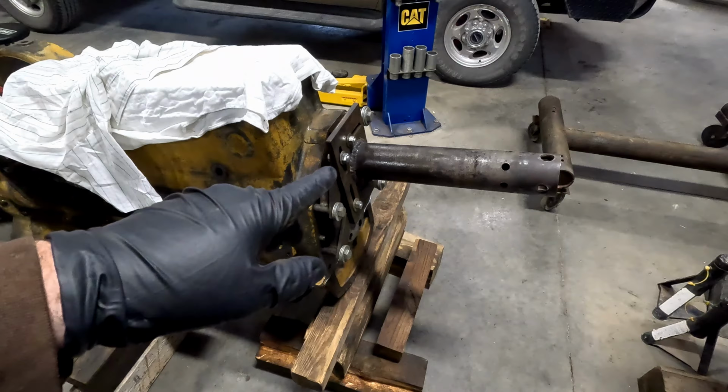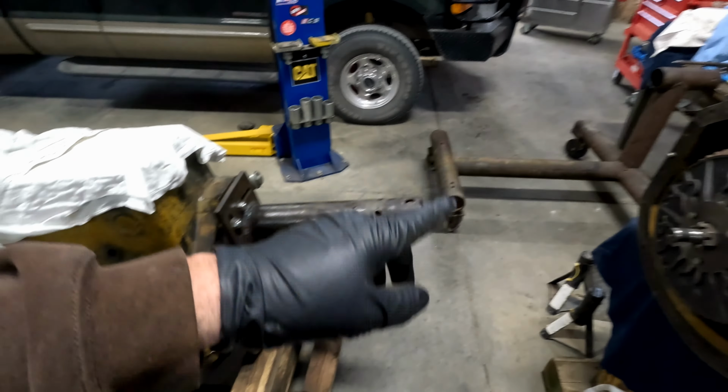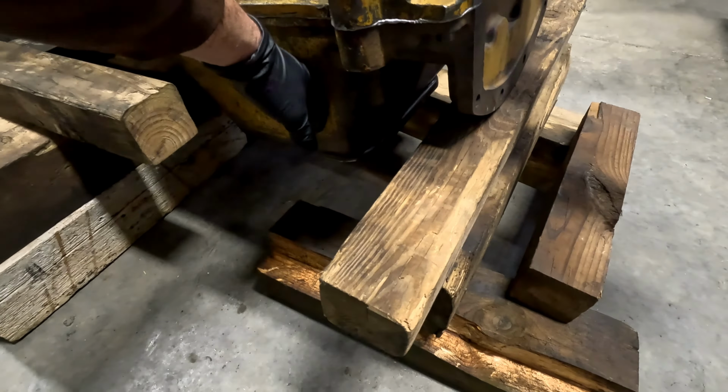When we finished putting the oil pan and the oil pump in here, this engine got super heavy, and we had measured, and we were absolutely sure that it was going to spin around on that engine stand just fine, but we didn't consider the angle that it has to travel. Yeah, it'll fit in there now, but it wouldn't have fit spinning around there because the angle at the steepest part of this oil pan wouldn't allow it to twist around that engine stand. So we realized very quick that we're going to need something a lot heavier than this shop crane to move this engine around.